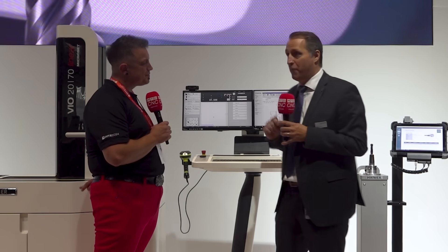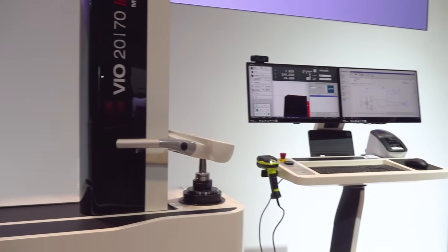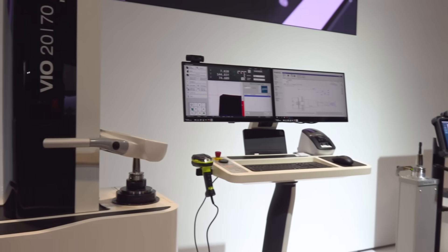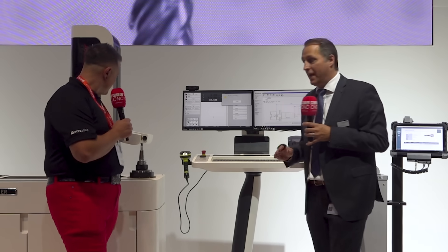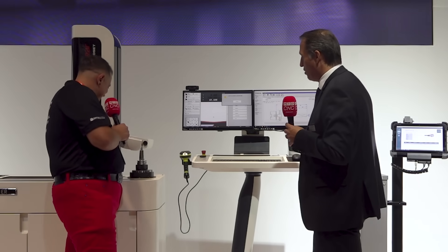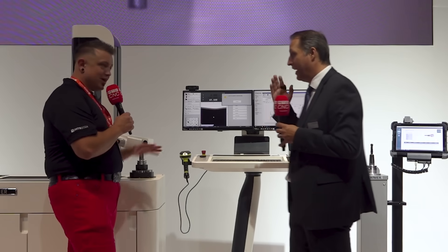In this case, it's not a button we push, but we would call it measure-by-touch. It's this little handle here. Can I touch it? Just double-tap it. And now the measure cycle starts fully autonomously, where we find the length of the tool by itself. I didn't have to program anything, you didn't program anything. No, I just touched it. The teaching time was less than two seconds.